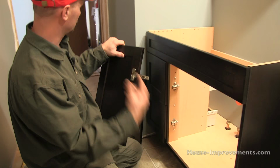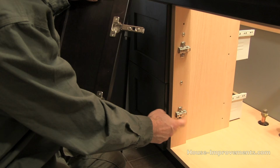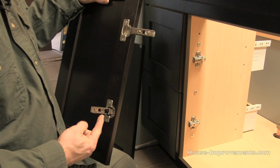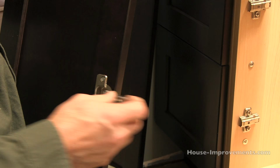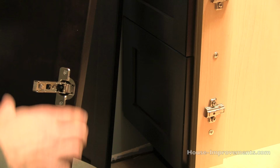So basically how this hinge works is you've got a plate or a bracket on the cabinet and you've got the hinge, the actual folding part, on the door. Most of them generally will have a lip here, a little crevice that hooks into the front edge on this bracket. And then you put it on there and you push this end back and it has a little moving part here that clips on the back side. Okay, now